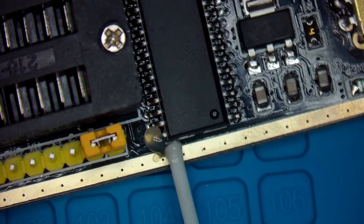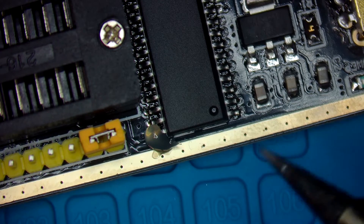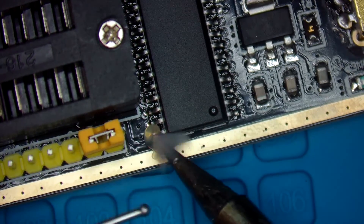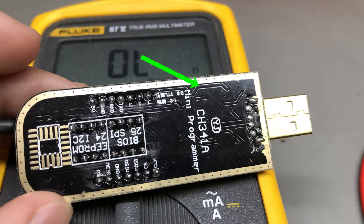One way to do this mod is to lift pin 28 from the pad, add some insulation between the pin and the pad — maybe some Kapton tape — and then solder a thin wire connecting pin 28 to 3.3V. Messing with the track bringing 5V to the chip is risky because we don't have a board view; we don't know if that track is connected to something else under the chip, so it's best to leave that alone and just lift the pin.